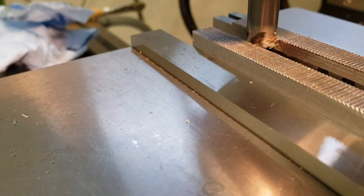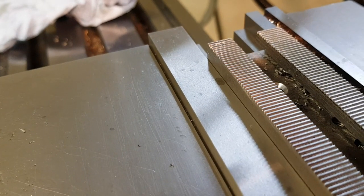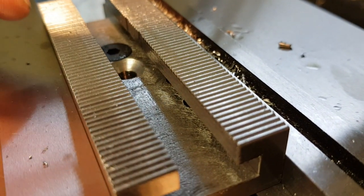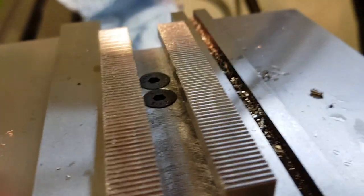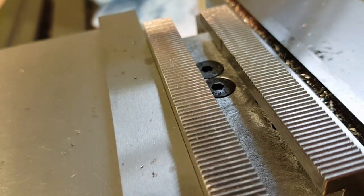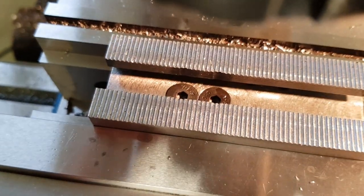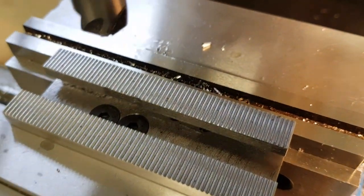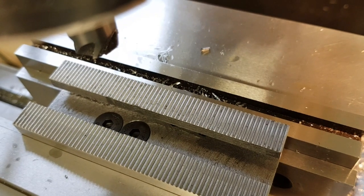It's difficult to see down there. I'll have to test fit the screw a few times to figure out how deep I'm going. I can countersink both holes and fit the screws. There might be just a slight amount above the surface here, but there is clearance for the turret so I think it will be okay. What was more luck than anything was the center distance between those two — I just used the same as I had used on the socket head cap screws. The head of these are much bigger, about 11.8mm.